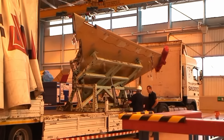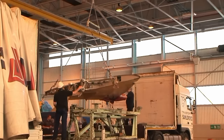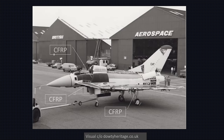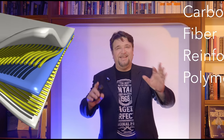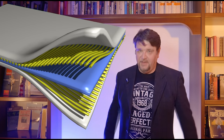Now we know composites much better and they are close to becoming the standard aircraft construction material, but at the time it was a revolutionary move justified by the potential weight reduction. On the EAP, large segments of the front fuselage, the canards, and both wings were built in carbon fiber reinforced polymers. We could easily dedicate an entire video series to composites. What is important to understand now is why such an extensive test was necessary.